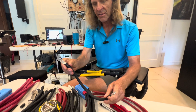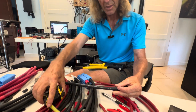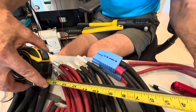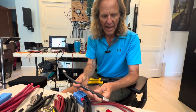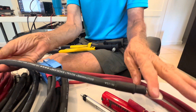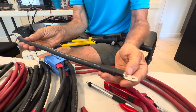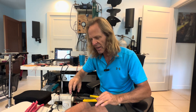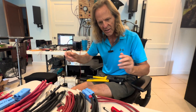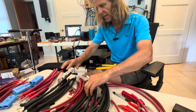The next one goes from the back of the BMS up to the battery positive, and it's also 14 inches — 350 millimeters. One lug is down and one is up, and it uses that same 50mm by 6mm lug, or 1-aught by quarter inch. If you're doing multiples, get one made up, confirm it works in your box, then lay it out and just recreate it over and over.